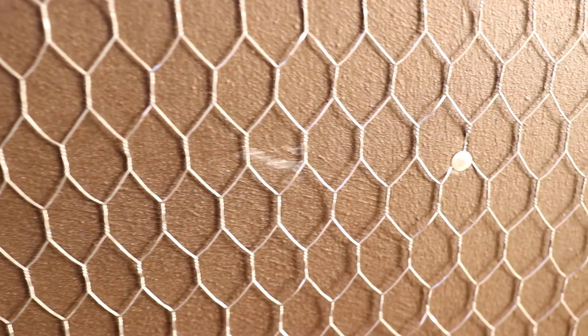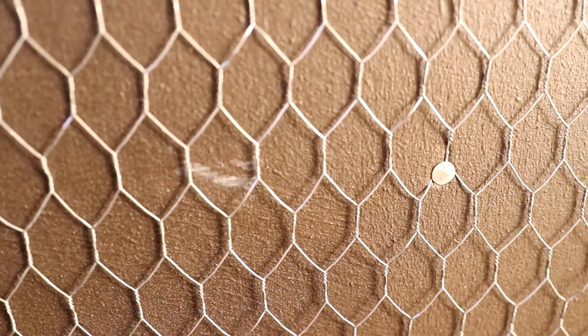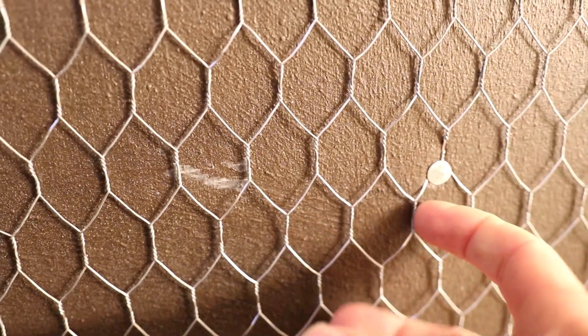So we've changed that. We've also started nailing into the studs. We not only staple our wire up, we put a roofing nail that penetrates through the wall board all the way into the stud — at least an inch into the stud. That way the wire is fastened to the framing members as well.